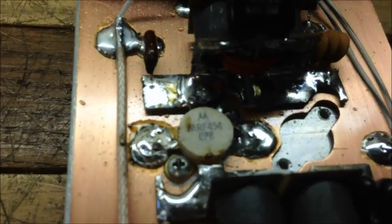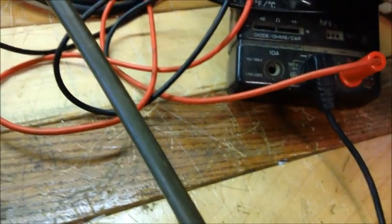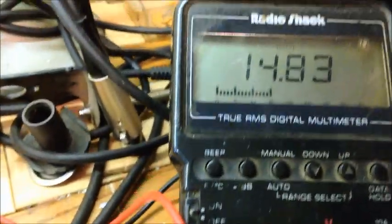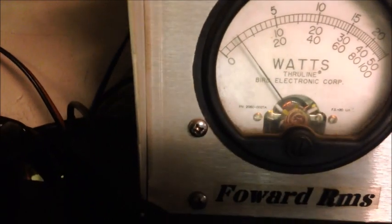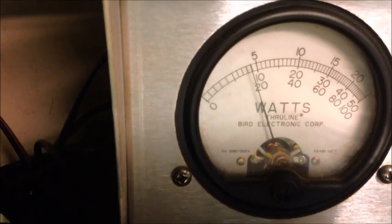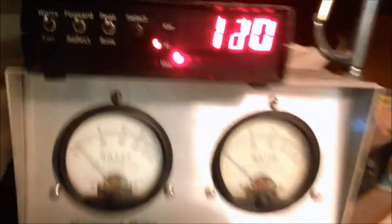Alright guys, the old Motorola MRF 454. I lost my ground line — hold on. 14.83 volts still, 250-watt slug. 15-watt dead key. About 45 bird. We'll be back with the next test.